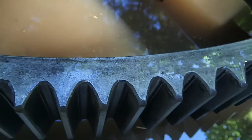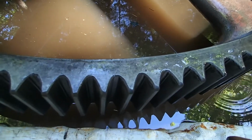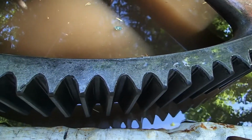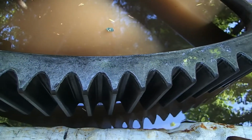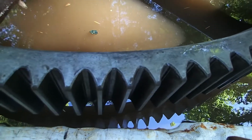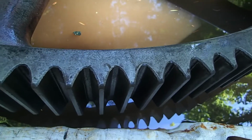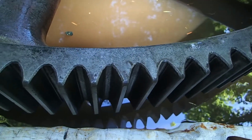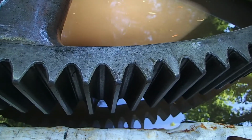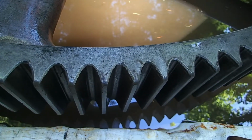It's gone. Does it take a little bit of wire brushing to get the black rust oxide off after the bath? Yeah, it does. But as far as cleaning machine surfaces, I really don't know if there's a better system for doing it. I can't really think of a cheaper system for doing it. And even when we're pulling 35 amps DC, at 10 volts or whatever it's working at, when you think of what's coming out of the actual outlet, it's in the hundreds of watts. It's not a great power consumer.